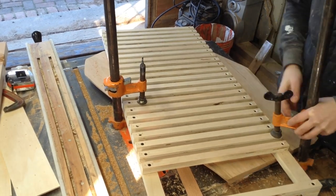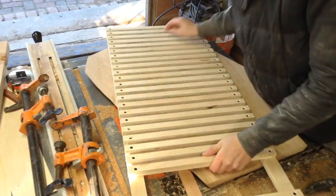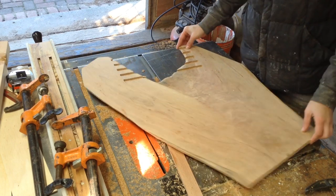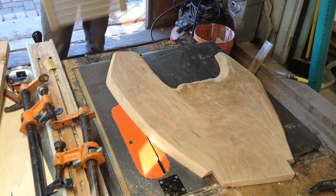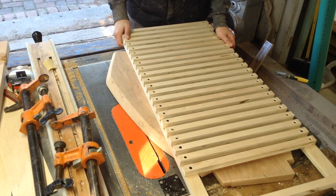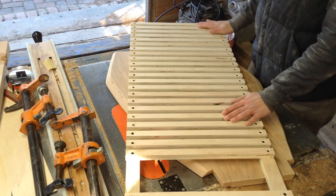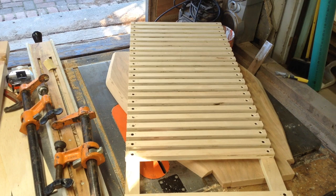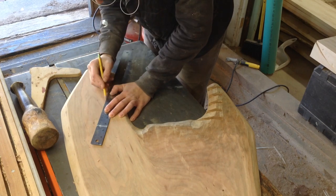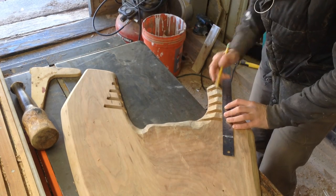This isn't structural, so I didn't go very deep — probably barely a half an inch. Once I had that done, I could put the jig on top of the second plank, set it up the exact same way. I put it at a little more of an angle and did the exact same thing. Once all of my routing was done, I went through and squared up the back side because I'm going to chisel them out to make square slots.